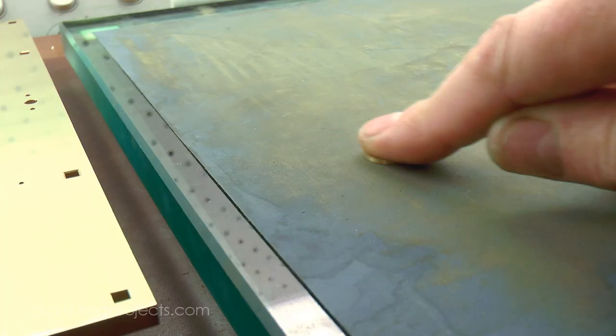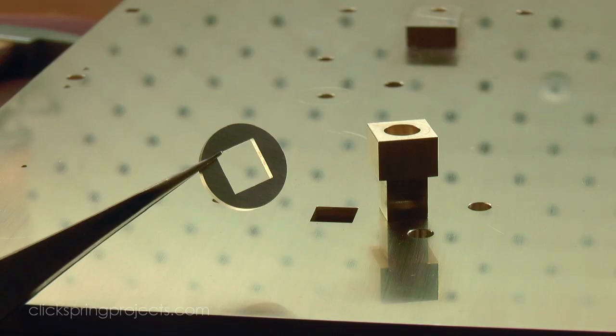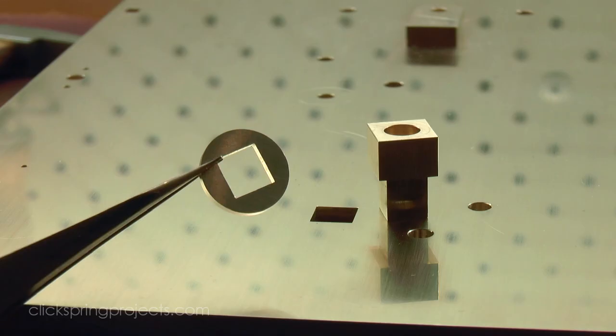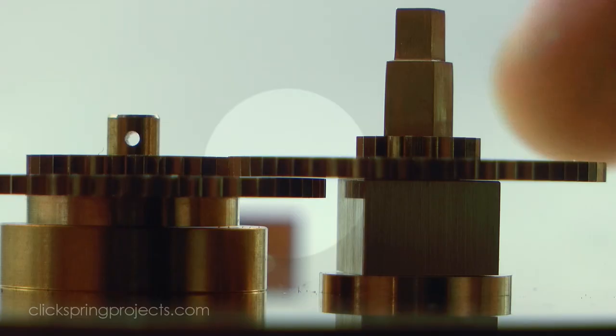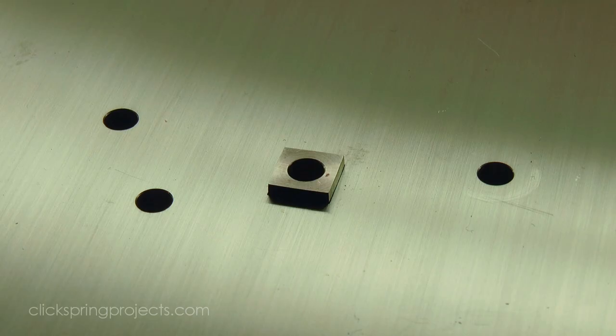The height of the Saros pointer assembly is set by the height of the bearing in which it sits, and that height can be easily set by this little spacer. I originally made it slightly oversized, but it's a straightforward job to set a clearance of just a few hundredths of a millimetre by simply abrading the spacer until the barest daylight remains between the adjacent assemblies. No special tools or absolute measurements are required, just keen eyesight and a flat abrasive surface.